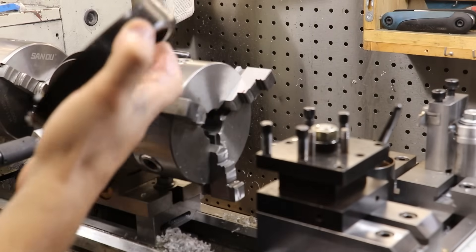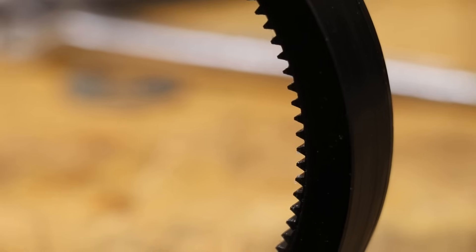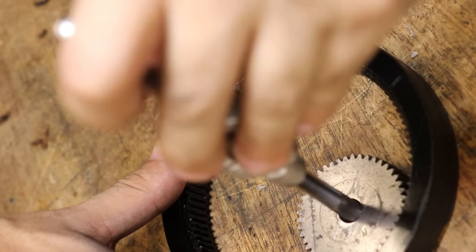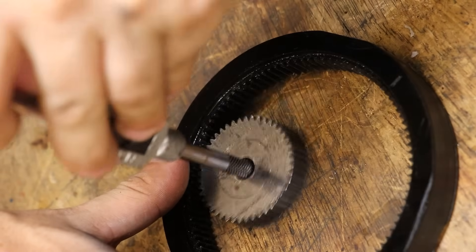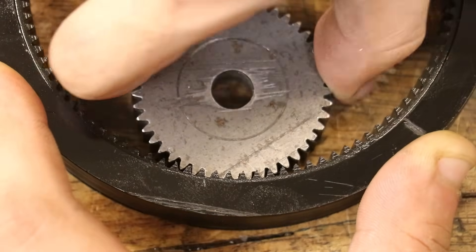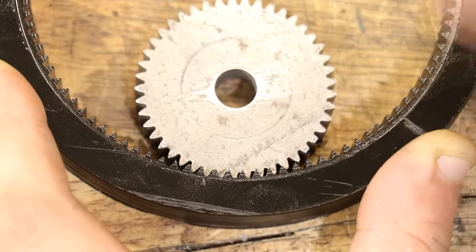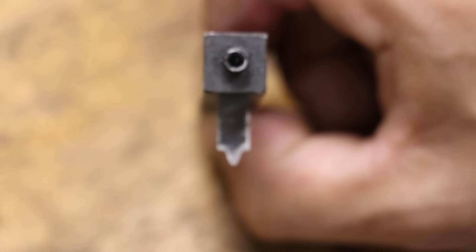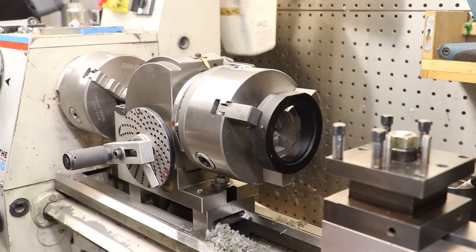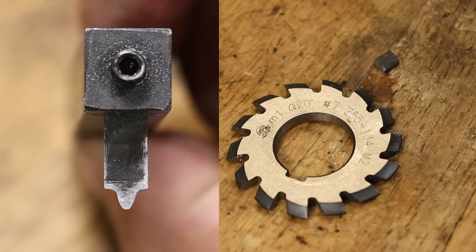After about three hours - yes it really took about three hours - the gear is finally done. I made about four changes to the gear cutter as I went along, and in the end I'm really happy with how it turned out. We get good movement between the external and the internal gear - there's no binding or hard spots, and the movement feels very consistent. Although the backlash does vary quite a bit and there is definitely more backlash and play than I'd like. So I'll load up that final cutter and cut a final gear. This one's set up to cut a 60-tooth gear, and I should be able to use this cutter to cut anywhere from about 55 to 135 teeth. Anything larger or smaller than that and I'll need a new cutter, in the same way you need a new cutter when cutting external gears.